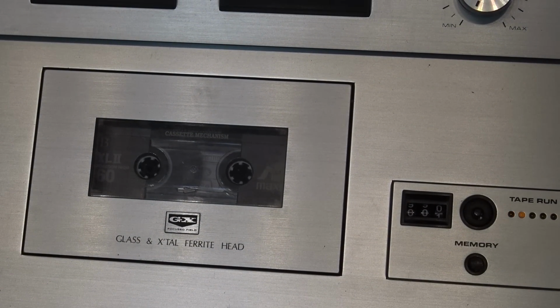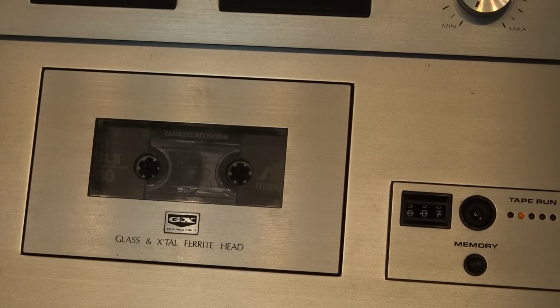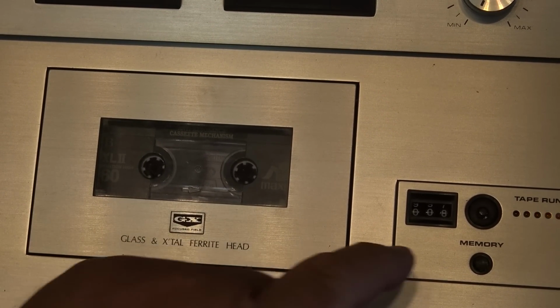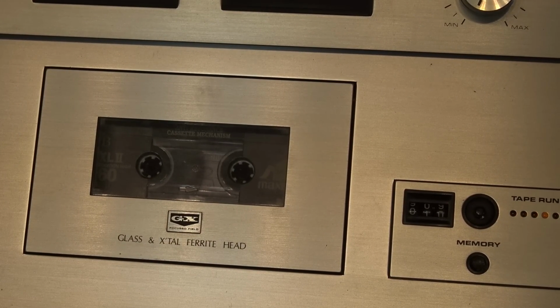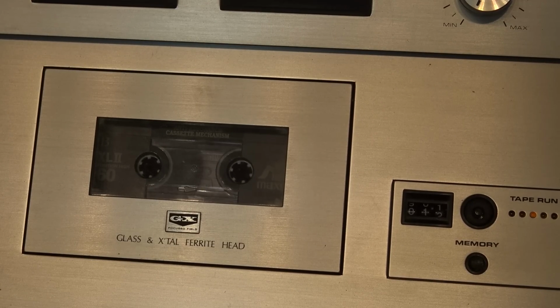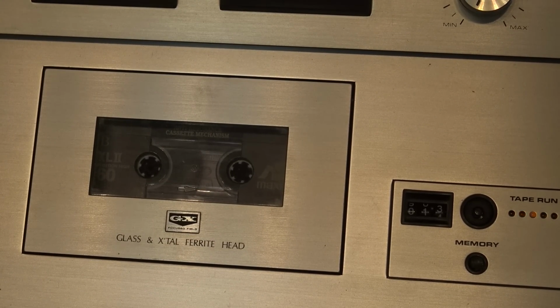Here we go. It's rolling over. I'm going to let this tape play all the way through, and if it continues without stopping, then I think it's a pretty safe bet to say that the problem was just the belt was slipping ever so slightly when it was on play because it was turning slower. See, on fast forward and rewind, there would have been the momentum of the actual pulley and everything spinning. But at the slower speeds, there wasn't the momentum there, so the slight bit extra drag required to flip the third number over was causing it to slip.